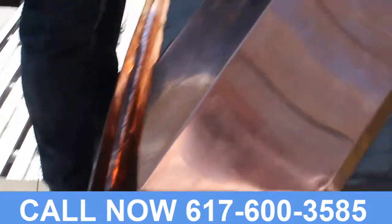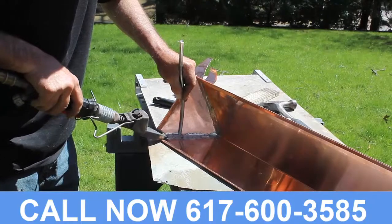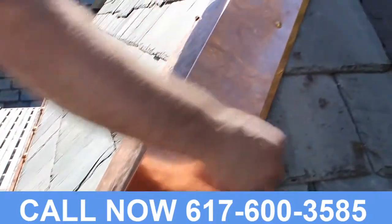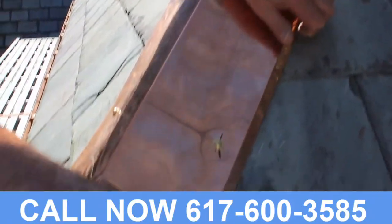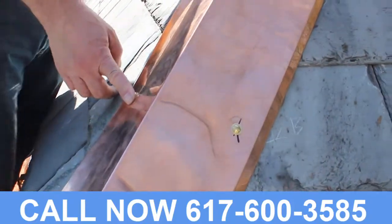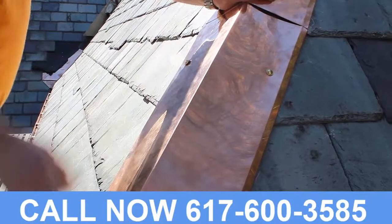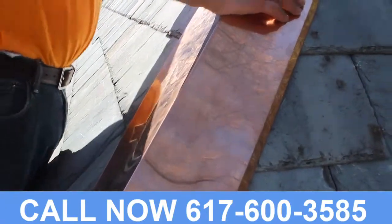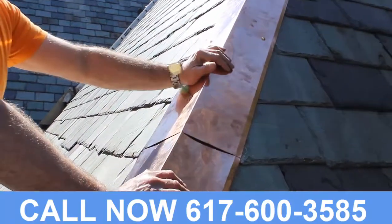Let's go to part B of this lecture, which is the hip cap over here. The hip cap is done in sections, and there's a hem over here, which means the copper is then bent again — this is really secured very well. This is a hundred years secure. These are solid brass screws, two-inch wood screws going right into the decking, spaced with a washer, keeping the water out, and really holding the hip cap to the deck.